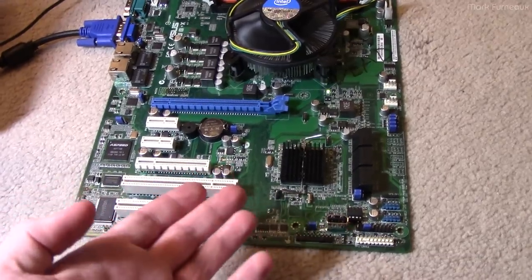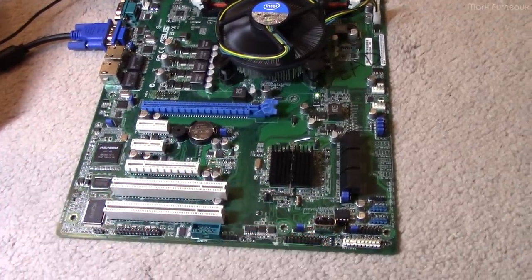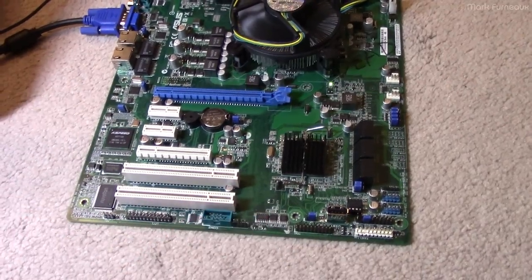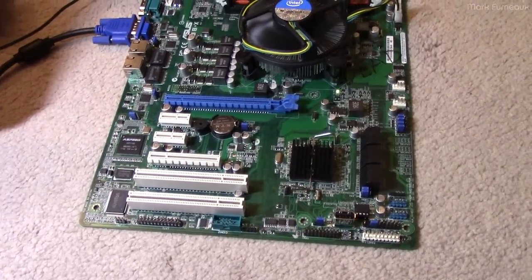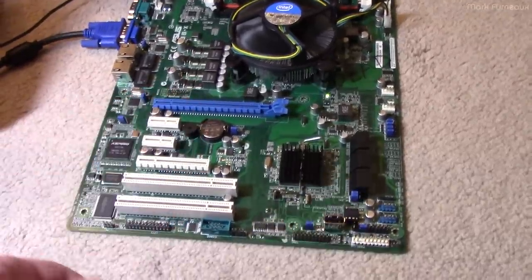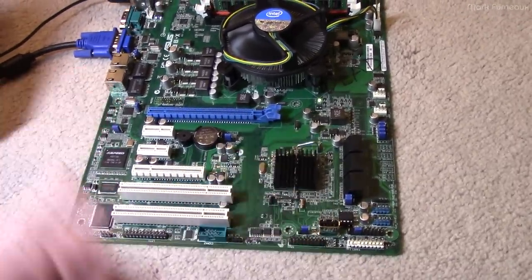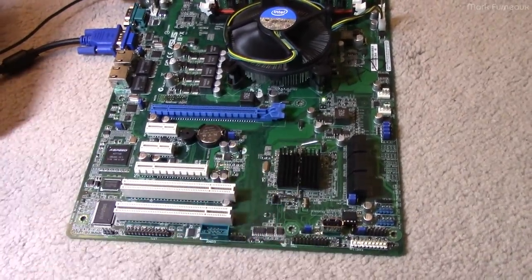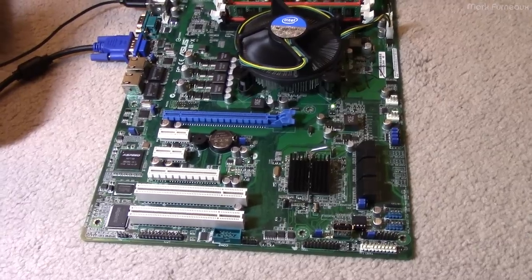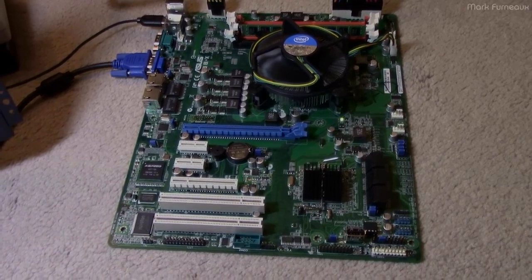This failed either due to some sort of bit rot or some erroneous write to that SPI device that corrupted something — whatever it was, it was probably a transient event. It doesn't seem to have a problem now, and testing will prove that. I might end up replacing one of my servers with it — the memory is going to be a bit of an issue because I don't have much of it, but this is a nice CPU, faster than a lot of the other stuff I have. That's how you go about diagnosing and fixing a board. Obviously if you have a dead board it's probably not going to be this problem, but maybe it is, and maybe this process is something you can take to try and diagnose the problem you have. Before the memory card overheats again, I'll say goodbye and hope to see you in my next repair adventure. Thanks for watching.